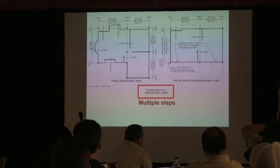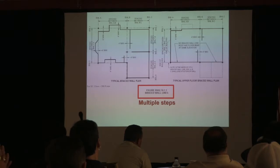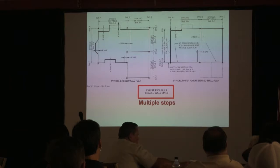That's merely the length of a wall: a braced wall is a wall line, and you put braces in there. Now, what we mostly see in this area is most of the houses we look at are OSB, right? They fully sheathe there. It's called continuously sheathed. That's the term that is used in the code book. When we were dealing with the Florida hurricanes around 2003 and 4, the price of OSB went really high. Also, you had things like Earthcraft, who were giving you a point system for an Earthcraft energy efficient house, so you saw a lot of foam panels. Well, OSB is a lot cheaper than those foam panels, so that's why you've seen more and more builders go to it. OSB is probably one of the best materials to stiffen the walls of the other bracing methods that are available, so that's why a lot of builders use it.